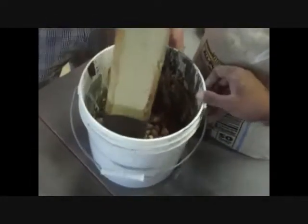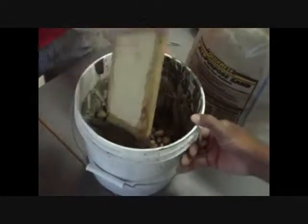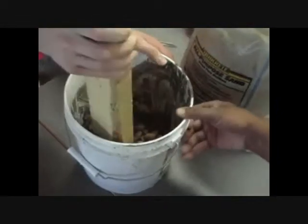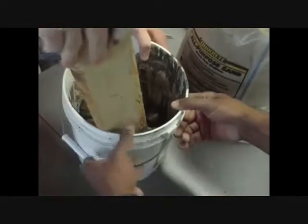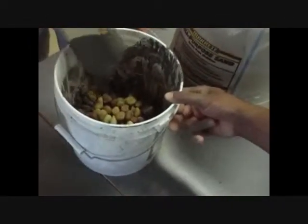Right now he's mixing the concrete for the pervious. As you can see, it's very difficult to mix — that's due to the water-cement ratio of 0.3. We use pretty large aggregate. It shouldn't be very wet; it doesn't require a lot of water.